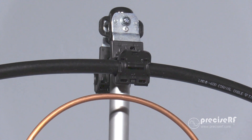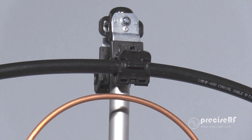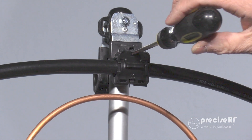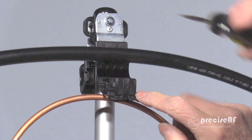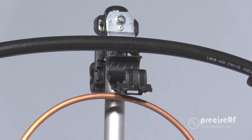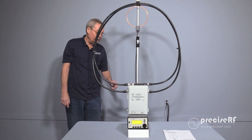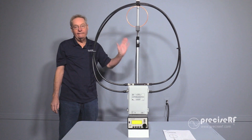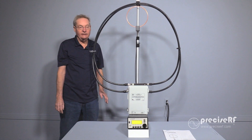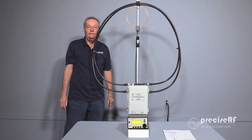Should you need to remove the radiation loop from the top clamp, simply locate a flat-bladed screwdriver, place it in the plastic section above the loop, press in, and the clamp will just open up. In wrapping up today's video: if you want to run 40 meters again, simply swap the two coaxes and let the 80 meter loop hang — the 80 meter loop will not affect the 40 meter operation of the antenna, so it's an easy way to go back and forth between the two. I'm Rob Kirkpatrick with Precise RF. Thank you for watching.